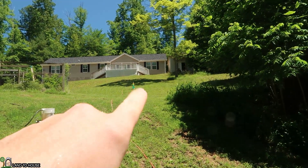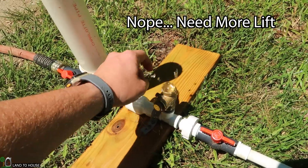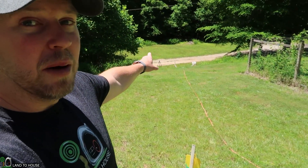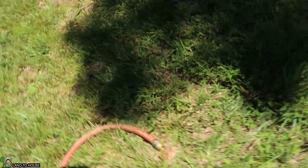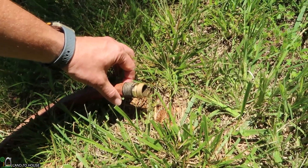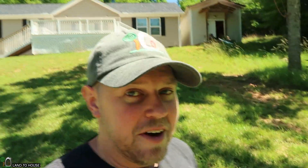The hose is right up here next to the shadow of this tree, so hopefully that's enough lift to get enough back pressure on the pump. That worked fine. The problem I was having was there's not enough hill to keep pressure back on the pump — we've got about five feet of drop and we're only lifting about 10 feet up from there. Here is the current output with the delivery pipe nozzled way down, and you can see that's a pretty good flow for that little pump. It was very helpful to have the pipe mostly full already.